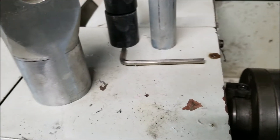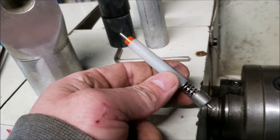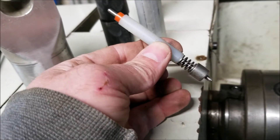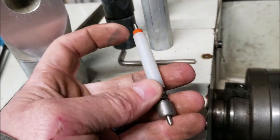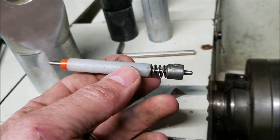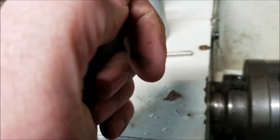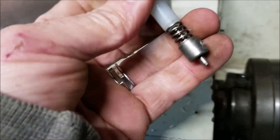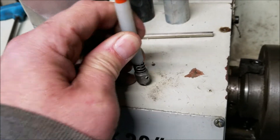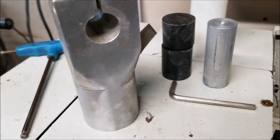One of my subscribers saw a video of mine and wanted to know how I ended up making my drag engraver. Here's one I made that would fit in a collet for my bigger machine, but I'm not going to use this one — I'm going to take it apart because it's just ugly as sin. Basically all it is is a body with a hole drilled through for the drag bit, spring-loaded and captive by a drill stop on one end and a push-on collar at the other. When it comes down it'll compress and put some pressure on it, then when you drag it it'll actually scrape into the material you're trying to engrave.